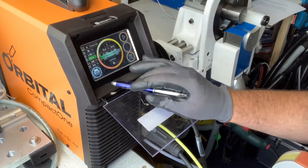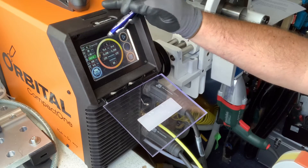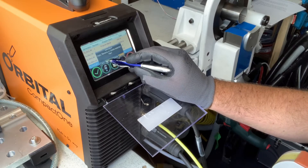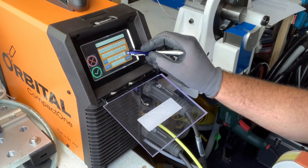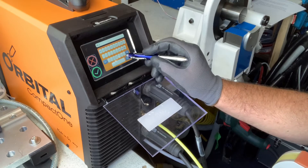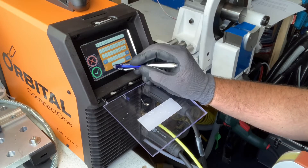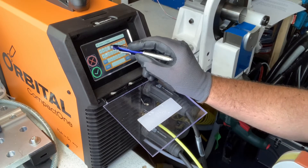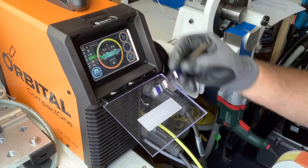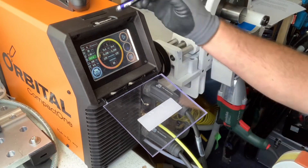We have to wait and not touch the screen while the program data is loading. That's downloaded. It gives you a new program at position four. You can change and push that — snap to position four — and you can give it a different number, like program nine, or put whatever you want in here, so we'll name it 38.1. So that's now named. Select that and now we have the name come up here just for easy reference.